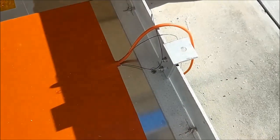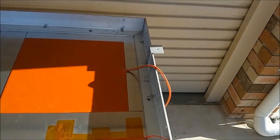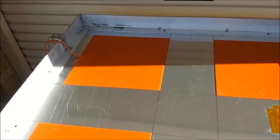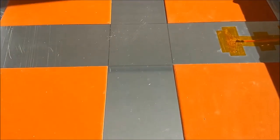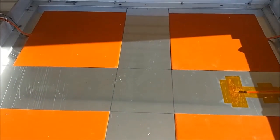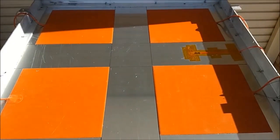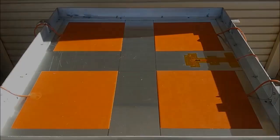There are four brackets just for mounting onto the printer, and I'll be able to vary the height on those just to make sure everything is square. When it goes onto the base of the printer, I'll put some insulation wool — quite a nice thick layer — so there shouldn't be any heat going down. And that's it, ready to put on.